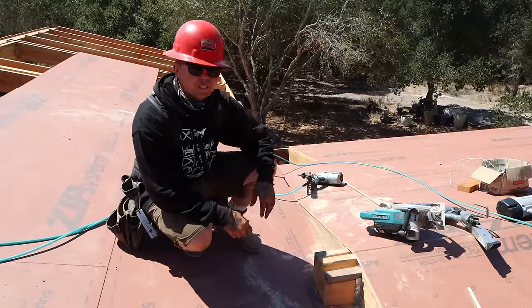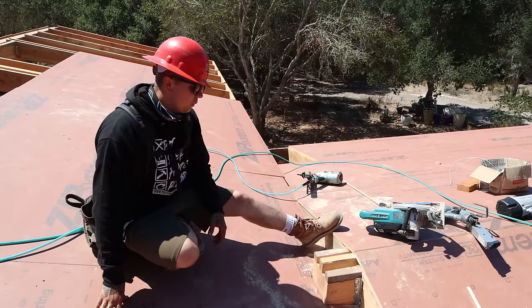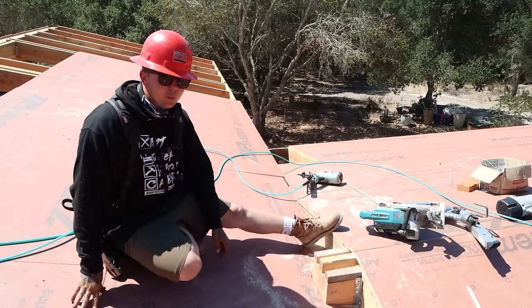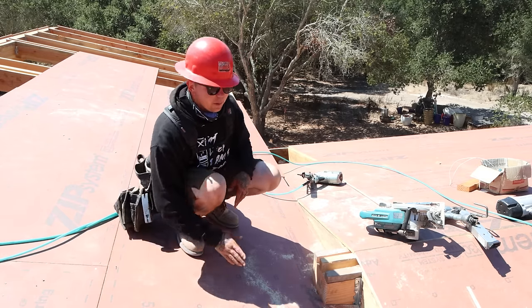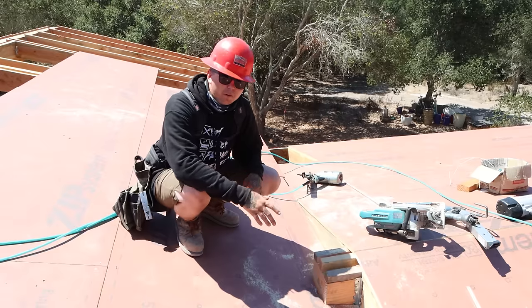So when we get into spots like this, where we've got this roof right here coming back over onto this one, what we're going to do is build out what we call a cali. I know it has a different term other places, such as an overframe. We're gonna run a ridge out to where it planes in here and then build back and then shoot this little guy. It's pretty much a dead space where one roof laps another.